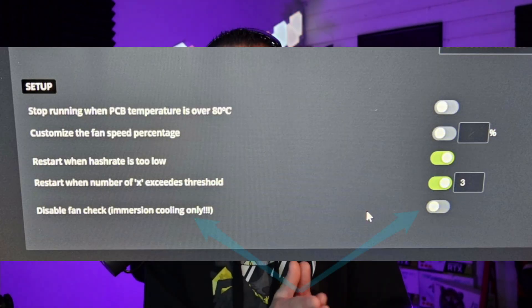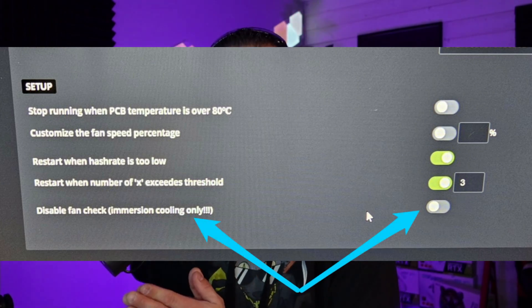I love doing DIY stuff, but when I thought I bricked my Antminer S9, that was absolutely terrifying — because once you break it, there's really no way to bring it back, it's just done. Thankfully it was just those fans. Huge shout out to that guy on a forum who mentioned the fans — once they plugged the new ones in, his machine fired right up, so I gave it a shot. Thank you to my man Rondi for letting me know about those four-pin dummy plugs. If you guys know any other way to bypass these four pins — I think you could do it in HiveOS for some machines, but I don't have the option for the S9 to check off liquid cooling to shut that sensor off — please leave it in the comments below.